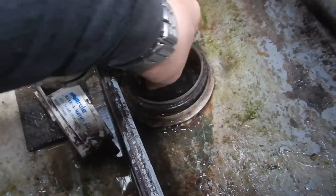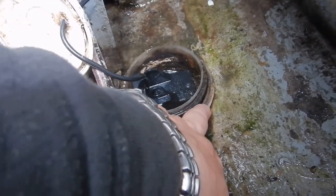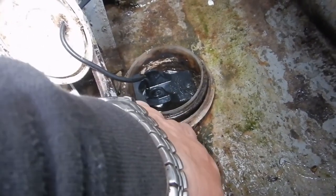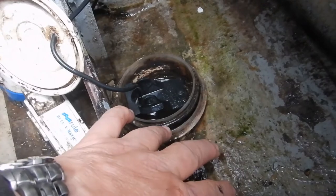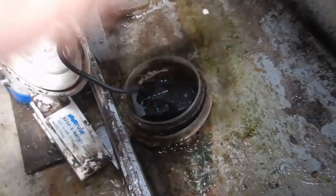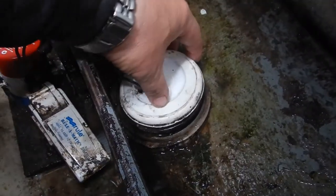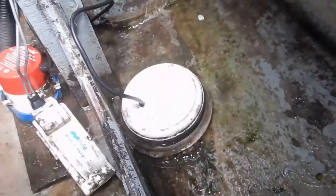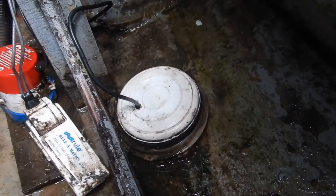The transducer just sits in the pot like that. The pot is held in by another larger pot ring that was secured to the deck, and that's just to stop the echo sounder from moving around the deck as I'm tacking or chopping about in the waves. The lid just sits on like that, and that's how I mounted the echo sounder in my Hawk 20.